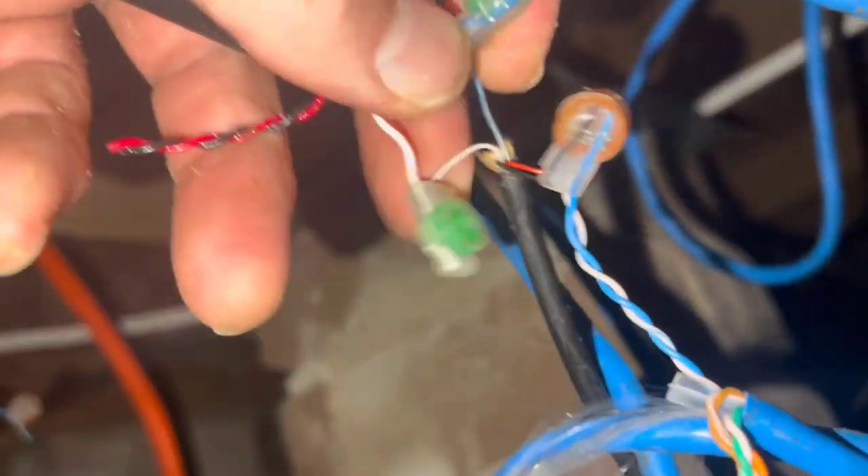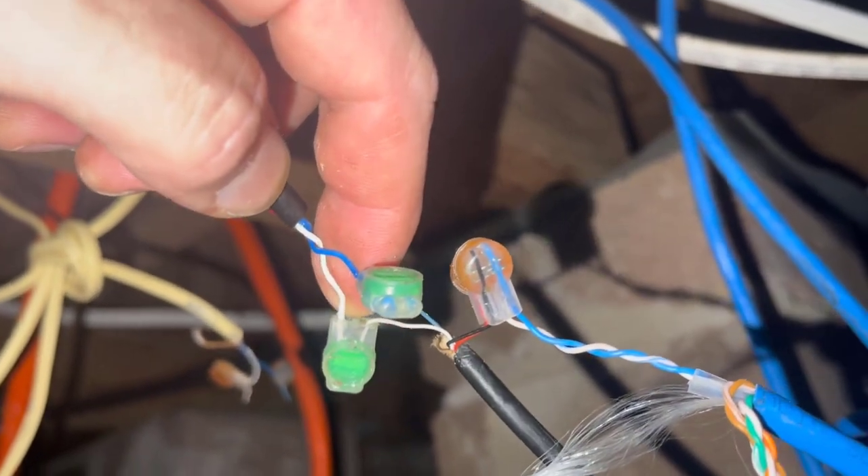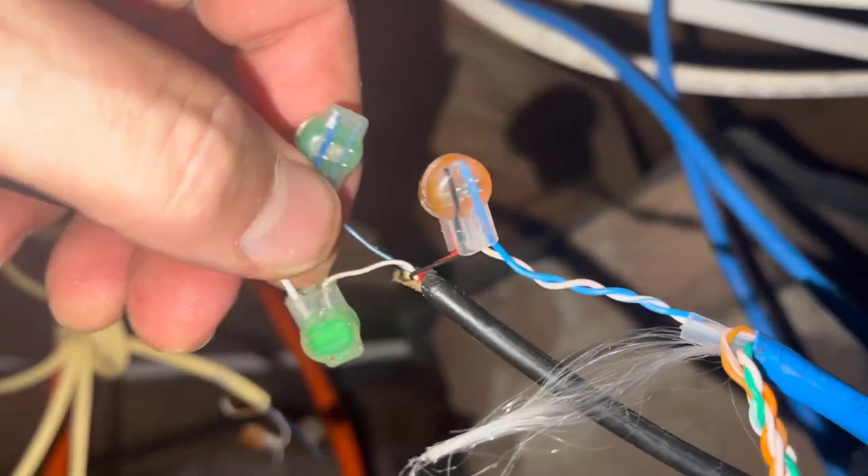After hooking it up at the DPU it wasn't really syncing. So I've popped back under to have a look. There's a nice clear tone on that one, but no tone on that one — and that is connected directly to the leading cable going back out to the street. I'm connected to the blue-white, and they've got their granny flat on the red-black going out to the granny flat. If I chop this off and get a nice clear tone on the blue-white on my side going back to the socket, but it comes clear on both sides, that means there's a problem on that leading cable going out to the street.